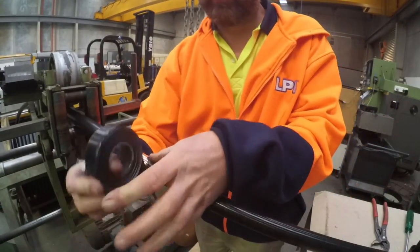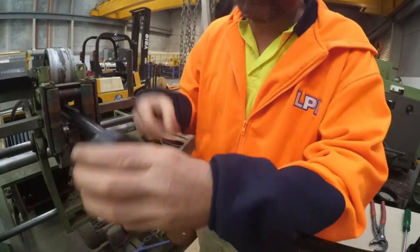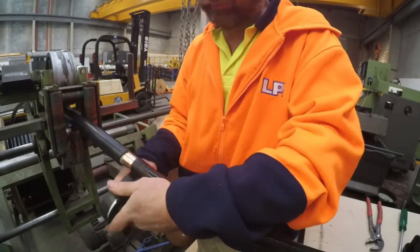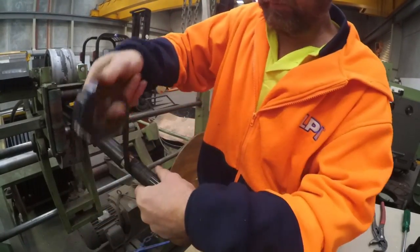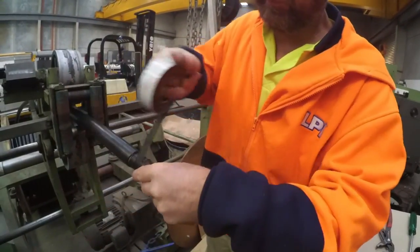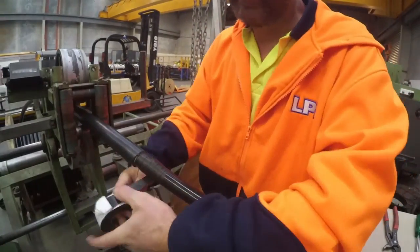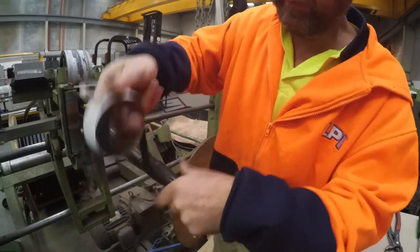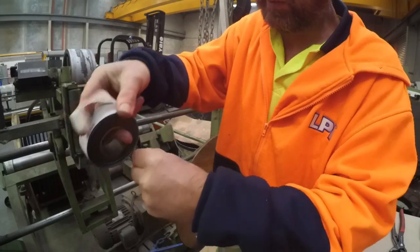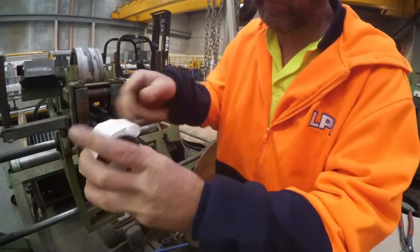Using the semiconductive tape provided, starting 2 cm in front of the end of the outer copper screen tape or 5 cm in front of the black outer sheath, stretch and wrap the semiconductive tape back over the copper tape and 3 cm over the black outer sheath with 50% overlap, securing the outer copper screen tape in place. This should use approximately 50 cm of the tape. Note, do not cut the tape at this stage.